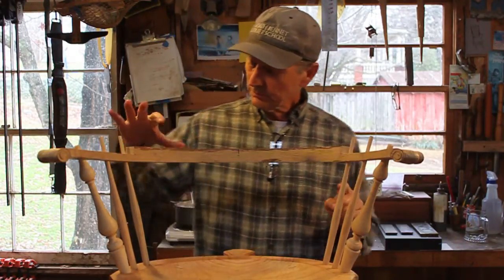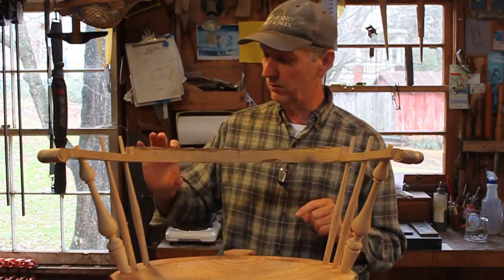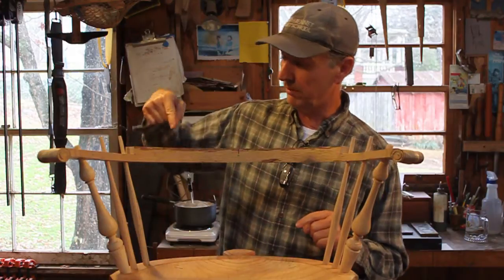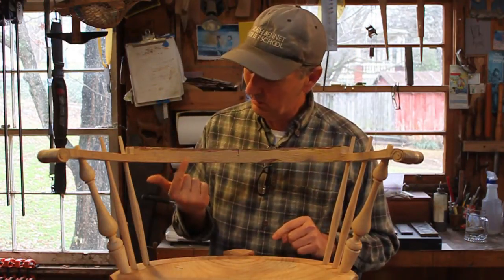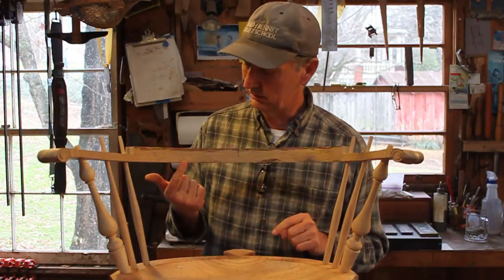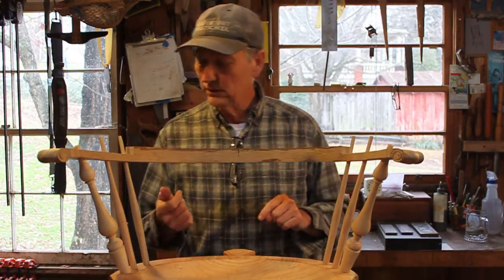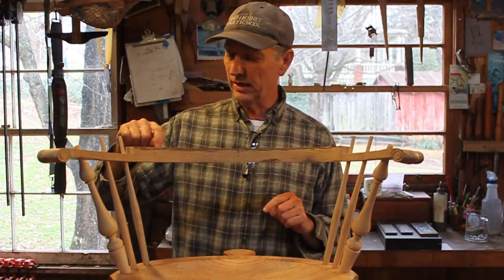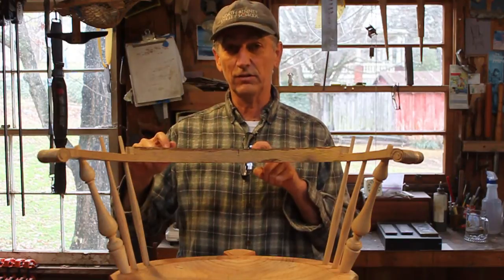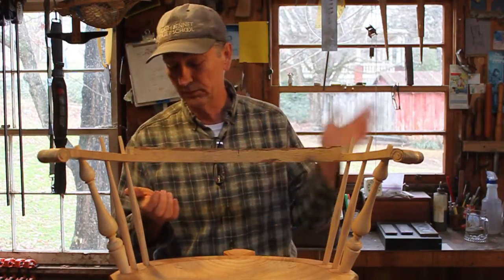This gets a little bit trickier than it does with the thinner arm rail, because I've got to pass through such a thick arm rail at an angle. You don't want to come out right here — it almost came out right there at one time, and that will ruin the whole arm rail. This is a 7/16 inch hole that I'm drilling here, and it's going to be tapered from the bottom — I'll be showing you that.